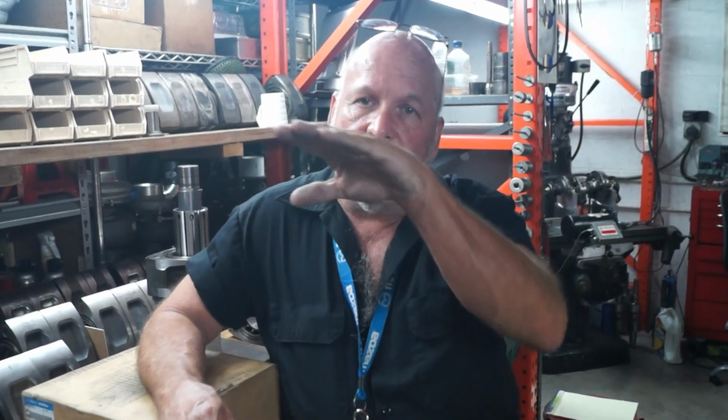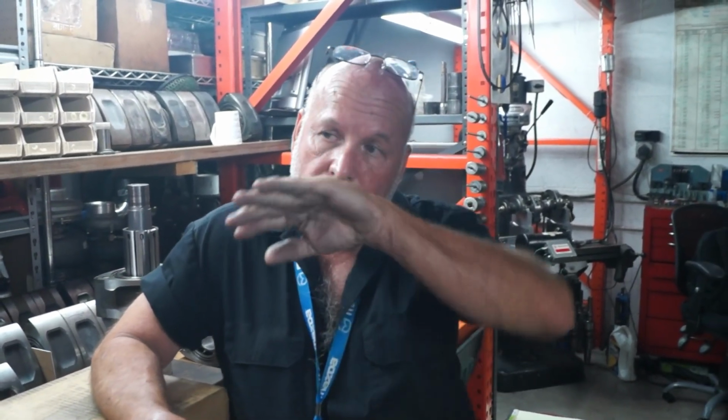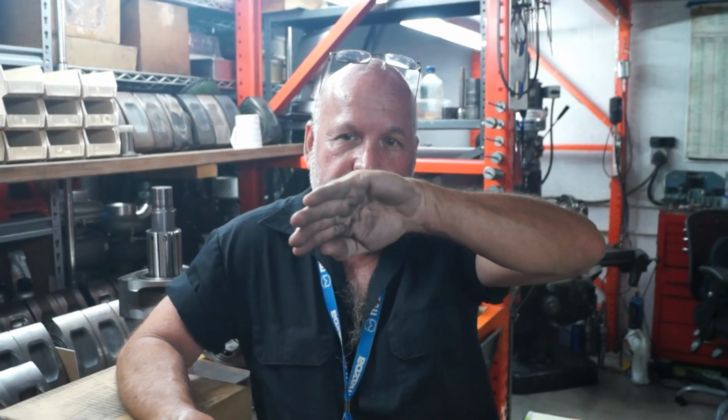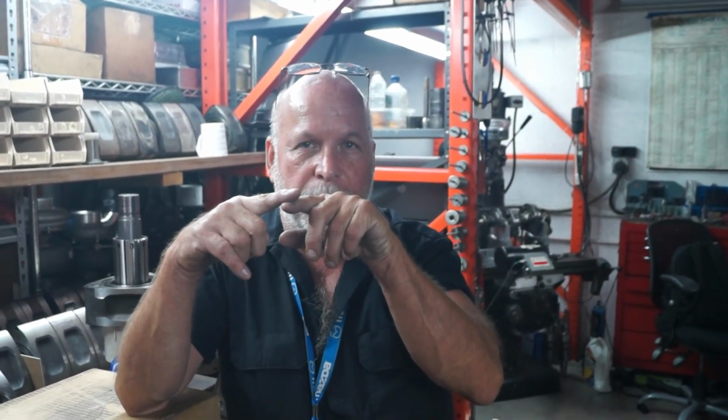By having that radius curvature of the apex seal be 1 millimeter wider, you would think it's not a whole lot, but it changes the arc of that radius from something like this to something like this. In the end, there's an infinite point of that arc which actually touches the rotor housing. But